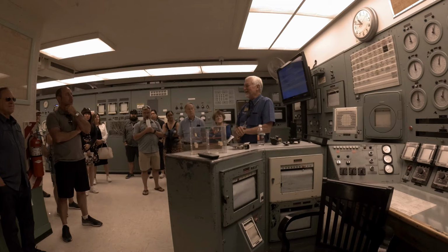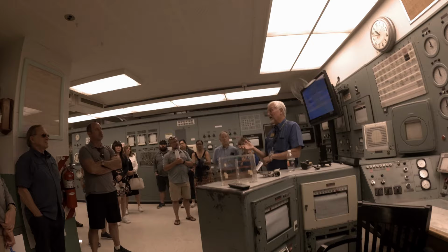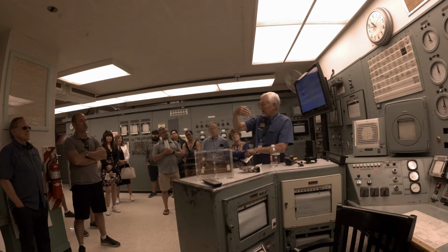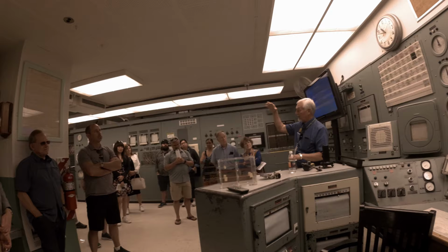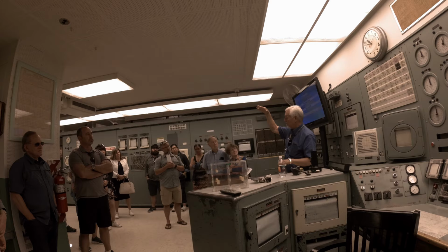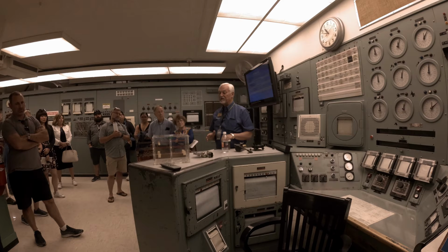So were there any significant incidents? B Reactor, no. It operated very efficiently, very effectively. It did shut down the one time. When you leave this room, if you go back out this hallway and take an immediate left into what's known as the accumulator room, there are 3 tanks in there. They're literally filled with river rock. Those tanks sit on a hydraulic pump, each one of them. When the reactor operates, they're lifted to the ceiling and held in place by an electric clutch. If the power is lost to the reactor, those tanks fall and pressurize the hydraulic system that pushes in 7 of those hydraulic control rods, with no interaction whatsoever by the operators.